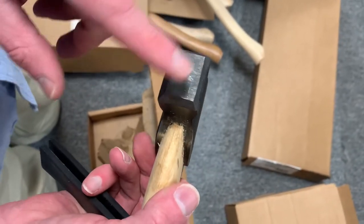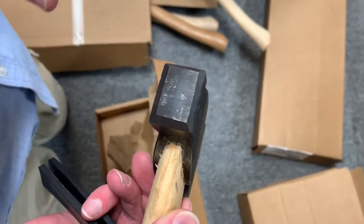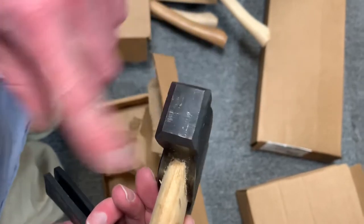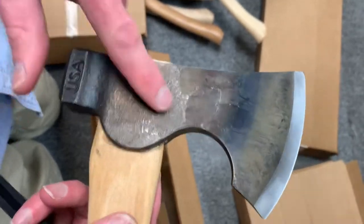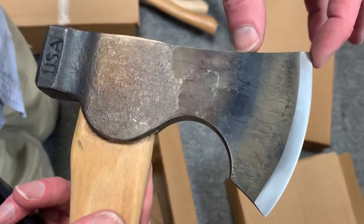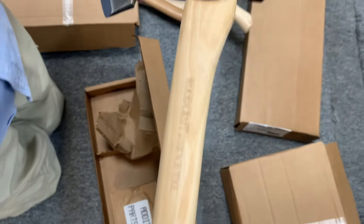The Woodcraft stuff is also hardened on the poll side and intended to be hammered with. On the Gransfors stuff some people don't like that it's not perfectly flat, but it is perfectly flat on the ones intended to be hammered with. This one is intended to be hammered with and Council Tool flattens it. By the way, they're not heat treated at the poll — the concern is breaking there, so you heat treat the bit here.